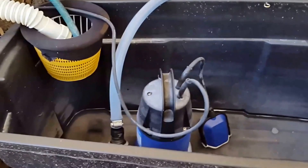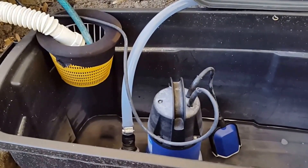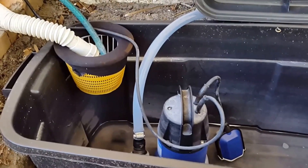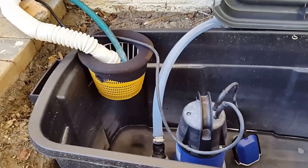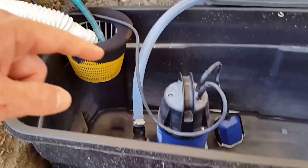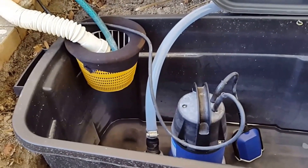This particular pump is a sump pump or sewage pump, so it is actually rated to be able to handle small and soft solids. The reason for the filtering is not so much out of concern for the pump, but more out of concern for your garden to which you are pumping. At least I know that if my filter for some reason fails, the pump won't get damaged because it is rated to handle small solid pieces.